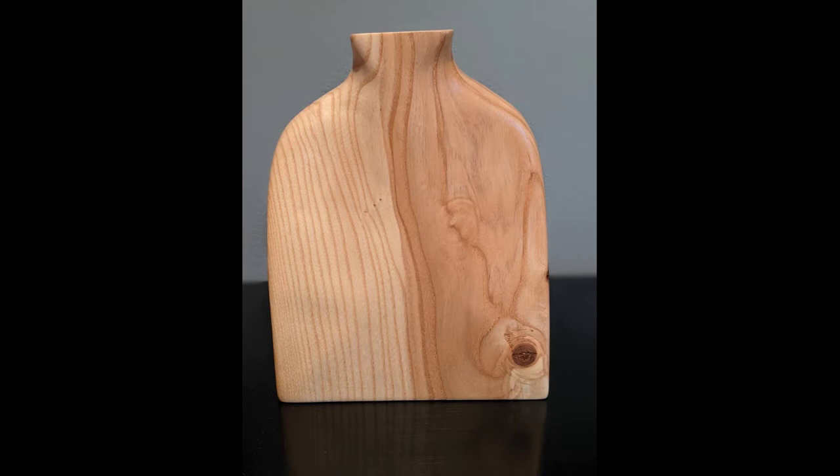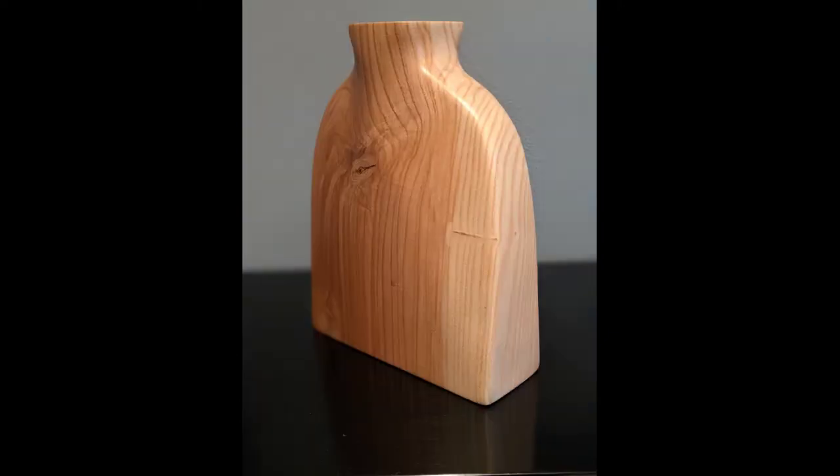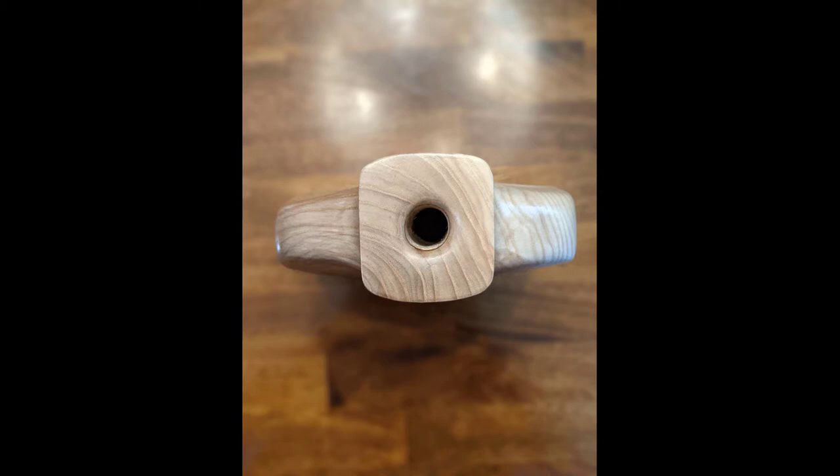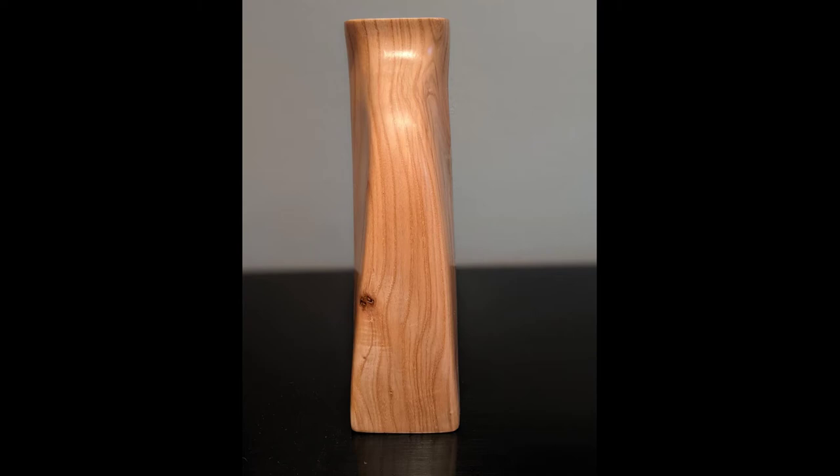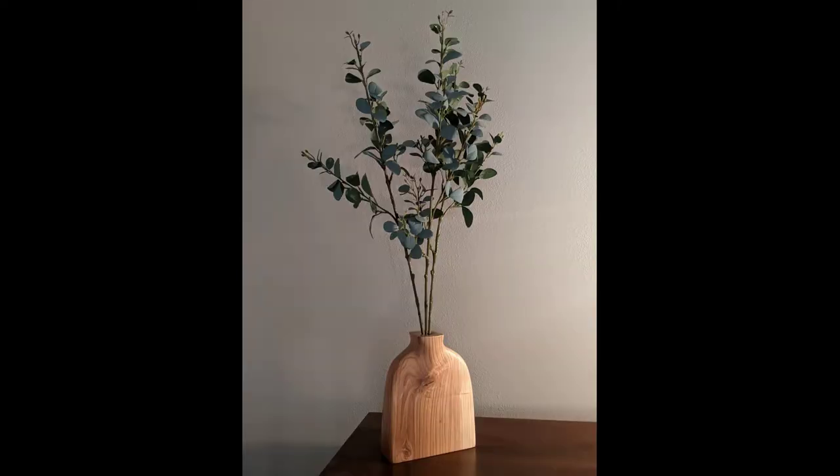You could do this easy. The hardest thing is having a piece of wood big enough. I used two inch ash for both of those, out of the same log split from a larger tree. Something that's two inches thick is a little rough to find at a hardware store, but you could glue up two boards if you wanted. The best way is to find a larger log and split out a big piece for yourself.